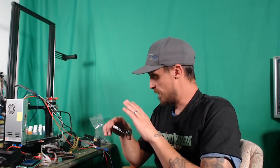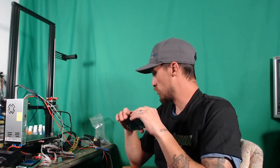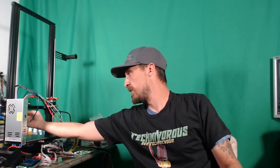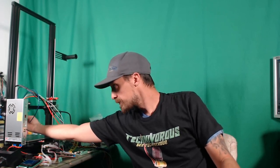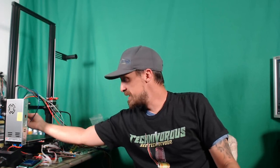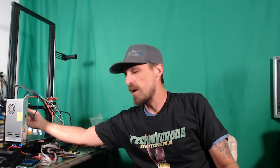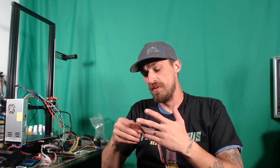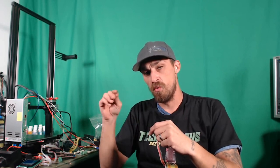I am very excited to get the extruder on. While we're on the subject, before we close out this video — the wheel that I turned around the nut on the X-Gantry: if you don't put the spacer in properly, it doesn't work. So the order, looking from the front — you're going to want to do the bolt and the washer on the front side, then put that eccentric nut in through the back, then the wheel, then the bolt. Just keep that in mind — this is something I should have specified previously.